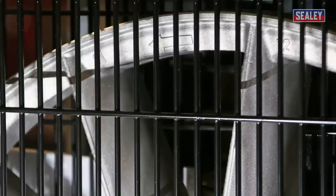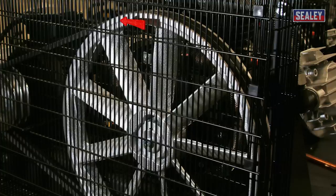For three-phase compressors: if the compressor is using too much oil or oil is leaking from the dipstick, this is commonly caused by it rotating in the wrong direction. Check the pulleys — they should have an arrow showing correct rotation direction, sometimes shown on the protective cage. If it's going the opposite way, it's been wired incorrectly and is running in reverse. Get an electrician to correct the wiring, then check and refill the oil level as necessary.